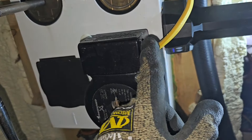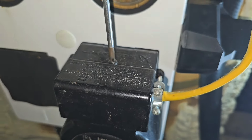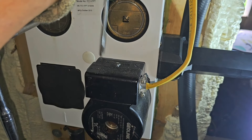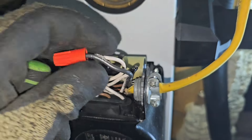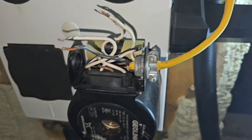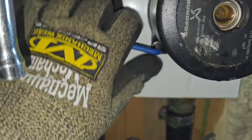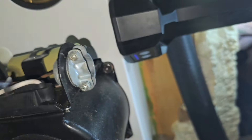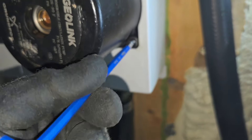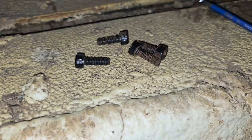Now since we've isolated this, we're going to take the wiring loose. We take the cover off by removing the screw that holds it on. There's our wiring — pretty simple: we've got a capacitor and then two wires. Take those off. Since we don't have power, we're good. We take this wire loose once we get the ground screw loose — take that ground screw loose and pull the wire out. Now there are four Allen bolts, one on each side of the pump. Take your Allen tool, loosen all four of them up, and once you loosen those, take them out and remove the pump.